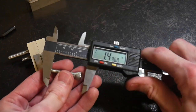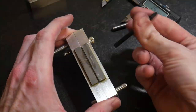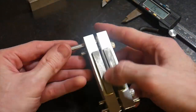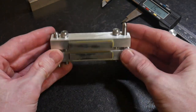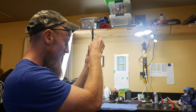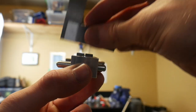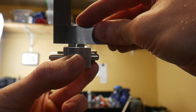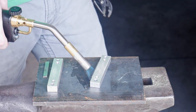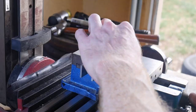At this point I thought I was done. I got some longer bolts so the guide opens wider, got the whole thing tightened down — then realized the two carbide inserts on top weren't as square or even with each other as I'd like. I ran a square over it multiple times, put light behind it, and I just wasn't happy. It wasn't off by a lot but I could see a little bit of daylight. So I applied heat to the epoxy and carefully knocked the inserts off to start over.